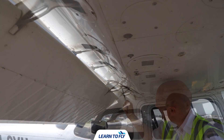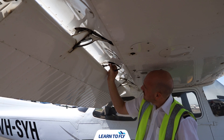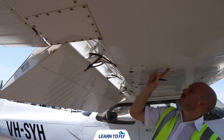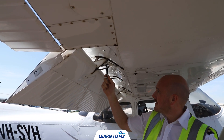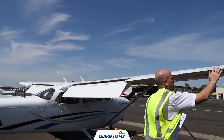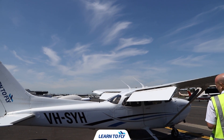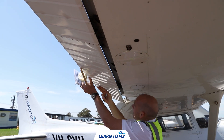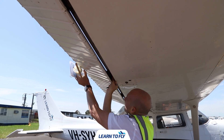Check the security of any nuts and screws, working your way across to the tip of the wing. Check any inspection panels for missing screws. Check the flap pushrod by gently twisting it — there will be a small amount of movement but don't force it. Also check the flap flange assembly for cracks, damage, or rust. For the aileron, check the free movement and security. Move the aileron up and down — the opposite aileron will move in the opposite direction. On the hinge line are two hinge assemblies with four nuts each; in the middle is a pushrod — gently twist it to check for a small amount of movement.